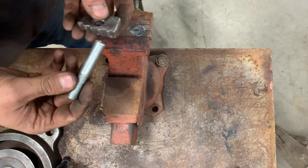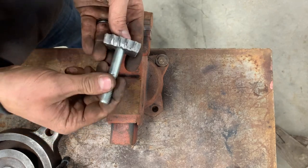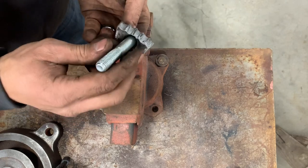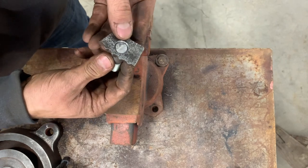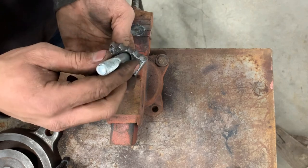Here's what we got going on: I cut the head off this bolt, beveled it out a little bit, and I'm going to weld that in there kind of flush. I beveled it so I get some weld in that gap, then we'll grind it all smooth, and this will be the part that goes inside the base. It's not very straight but we're going to make it work.